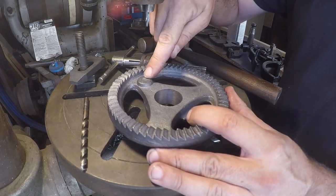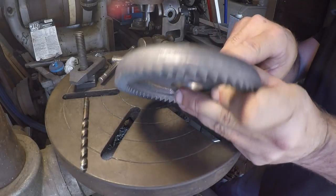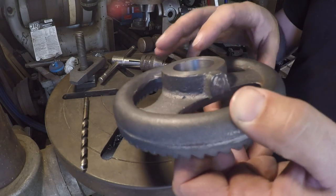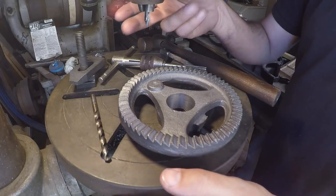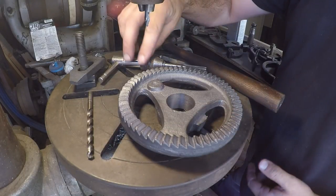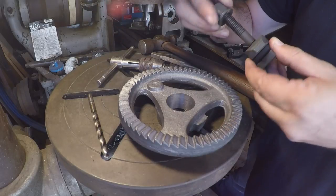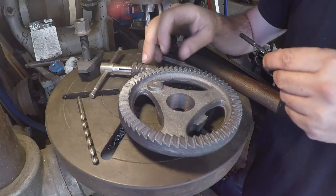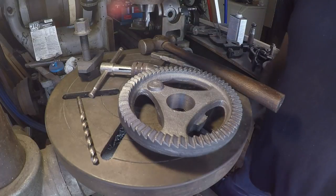The next steps: we've got to drill a quarter-inch hole here, and this right here gets drilled out to five-sixteenths eighteen. You can see the little ball that sticks out right here, so we'll have to change the setup on the drill press. I've got a small center drill, a center punch, a quarter-inch drill bit, mill clamping equipment to clamp this to the table, a five-sixteenths tap at five-sixteenths eighteen, and a seventeen sixty-fourths drill bit which is the tap drill size for that.